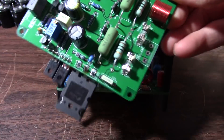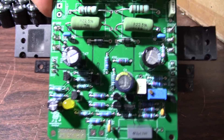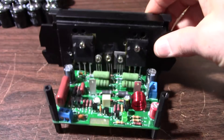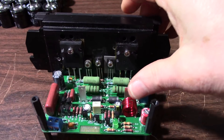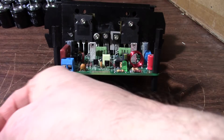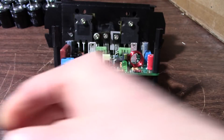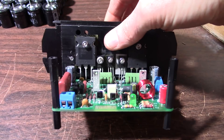The original design was the flat-on-the-heat-sink design, with the transistors sticking out like little ears on the side. But I know some people wanted to have this inline option. One difference on this board is there are no fuses, so you want to fuse each board in your amplifier on the power supply, whereas this board has the fuses right there. It makes it a little more compact. We're going to hook this thing up and give it a whirl.